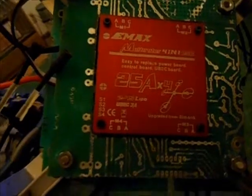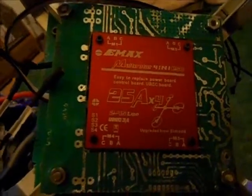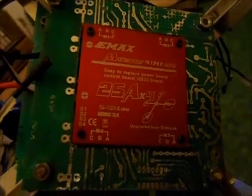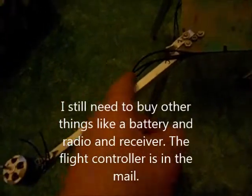That's the ESC — it's called an electronic speed control, designed specifically for quads and probably designed to work with these particular motors. All the wires are going to run inside this channel out to the motors. All I really have left to do is put on these little things called bullet connectors that plug into these wires, and little pieces of insulation, and then it's done.